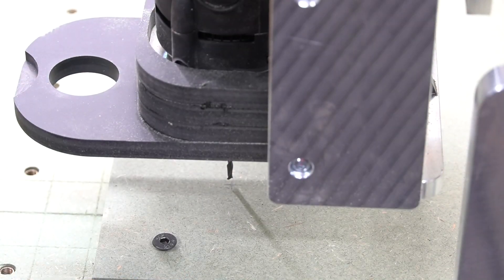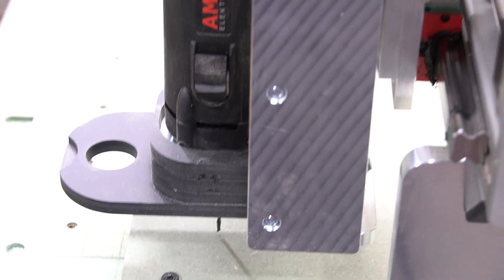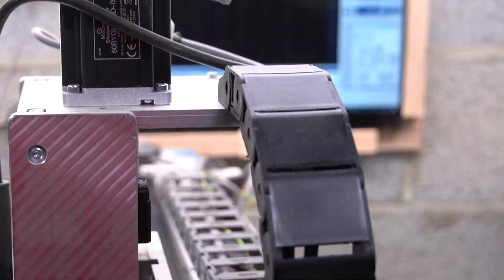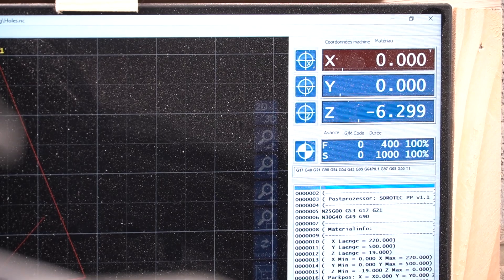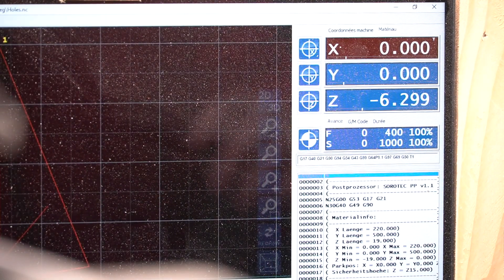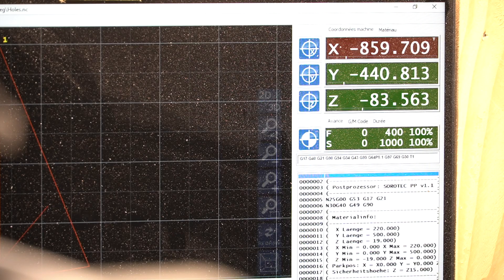This is the zero point of the new toolpath. I'm going to look at the absolute coordinates of that point. This is the job coordinates, and I'm going to change that to look at the machine coordinates — and this is exactly where the zero point of that jig will be. So we can reference it every time later on, because the jig will sit exactly at the same place on the wasteboard, and we know it's exactly the lower left corner of that cutout that we've made.